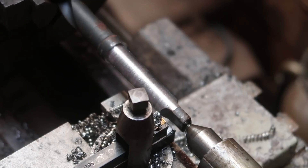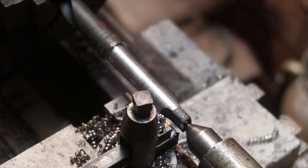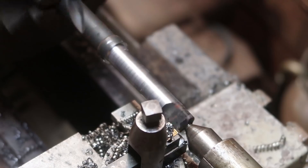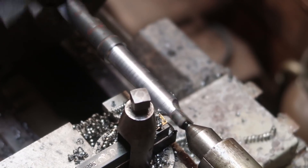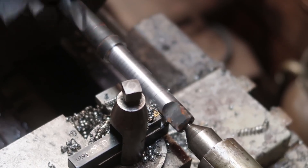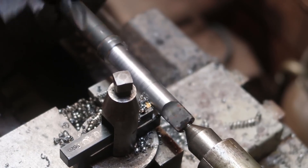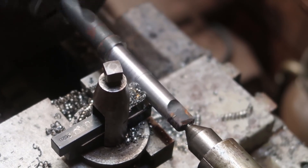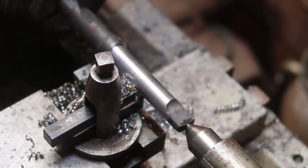One more pass. I'm going to be honest — I've kind of stopped caring about surface finish. Now I'm just interested in actually making things. I'm having to do it with one hand, so I'm using the small increment dial to move it instead of the big fast one, because there are actually two dials on the front of this lathe — one is a very fine adjustment and one is a very fast adjustment. I'm guessing this is what the fine one is for. That's why it's very stop-and-go for me, because I'm adjusting my hand — I'm having to use my other hand to tension the belt.